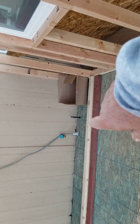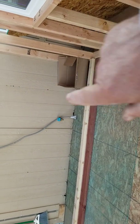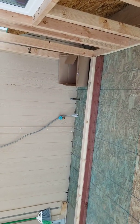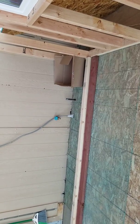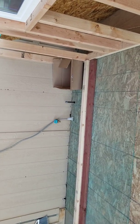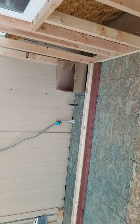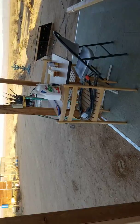I'm going to make a little metal flashing to put around that gas pipe so nothing can go down underneath at that location. If I make it out of sheet metal it'll be fine, and it can stay there even after I overlay this — it just gives me an extra seal to make sure nothing can come up.